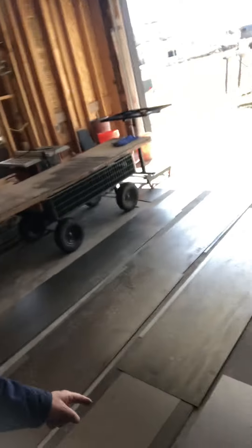We're going to do that a lot in this house. Here is some of the steel plating, 16-gauge, that we ordered to achieve that safety feature. We hope that gives you ideas on how to protect electrical wires and occupants where a lot of wires and pipes are penetrating the walls. Thank you.